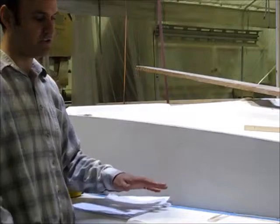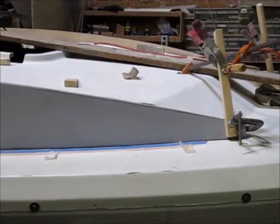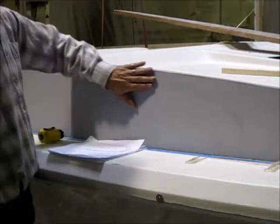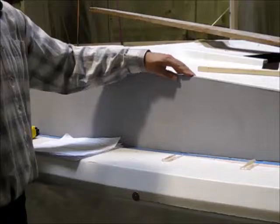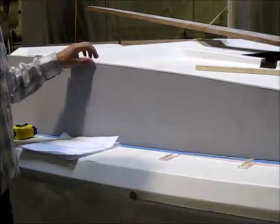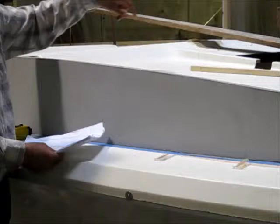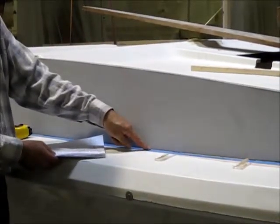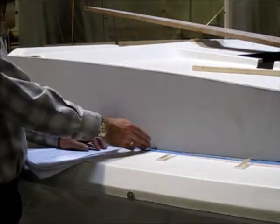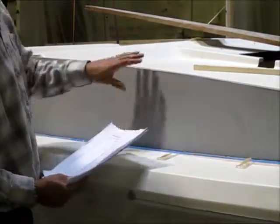The first thing we did to modify the deck was to lay out section lines. We started at the front of the boat and we're going every 12 inches — all the way back, lines numbered. First we're making this panel here, which is a half-inch MDF board — really nice for sanding and bending, very consistent. I've gone to the design and done offsets from the center line to a couple of points: the bottom here, the angle up from that, and also the height. So at each section I've got these three measurements, and with that we were able to lay this out.